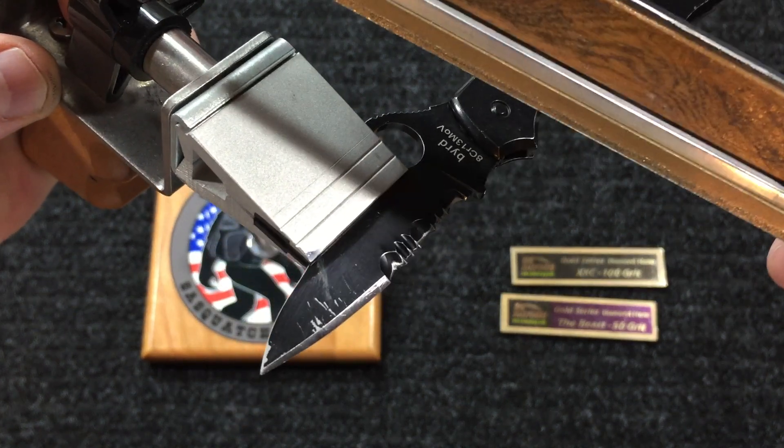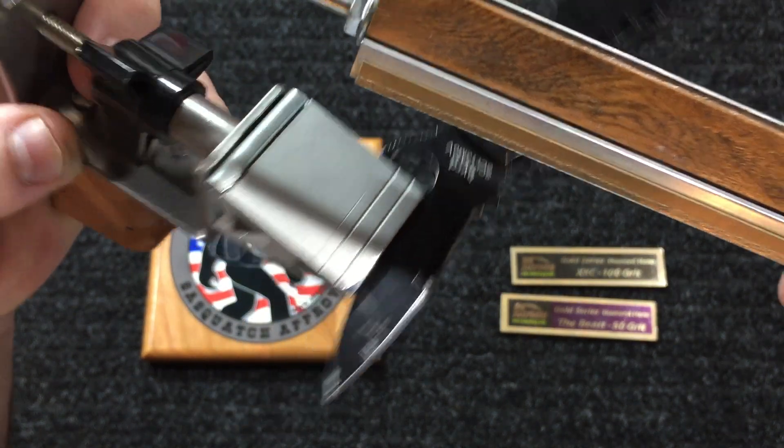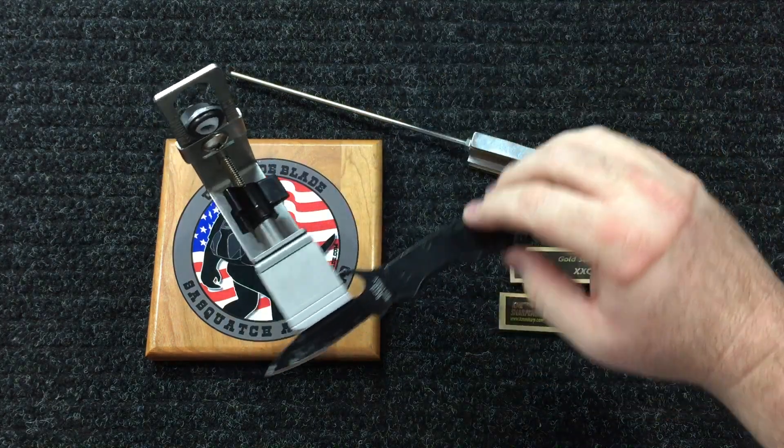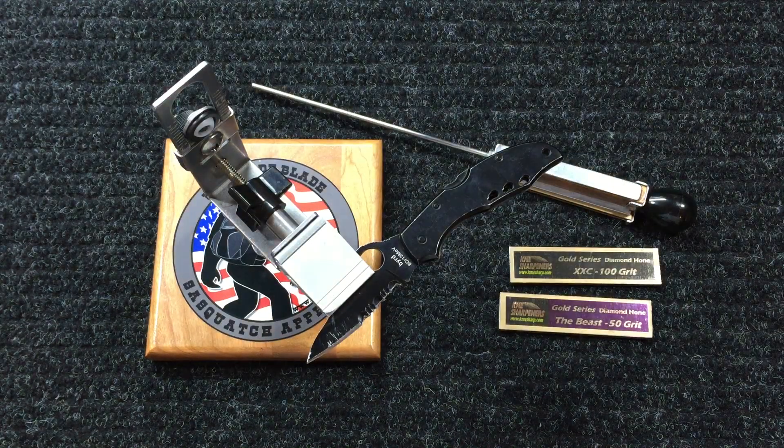I'm showing you the scratches in this blade — it's an old beater I've had laying around the garage, so I put it in there to show you. That's what's causing those scratches: new stones with little loose diamond particles getting caught underneath with the slurry, and obviously going too far off the stone and coming off the edge. Thanks for watching — I'm almost at 500 subscribers, I appreciate it very much. I see this question come up a lot — why am I getting scratches on my blade — and it's kind of hard to explain without showing, so I figured I'd make a quick video on it. Y'all have a good day, bye.